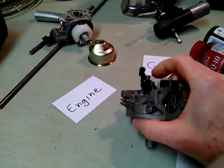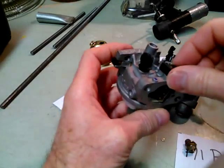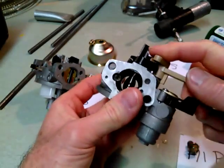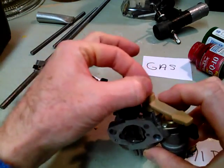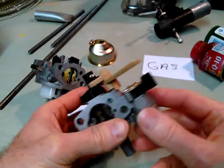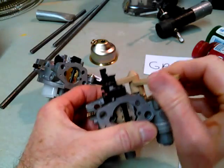One thing is that normally the choke doesn't have much friction, so it would move around when running unless it's wide open at the normal detent. When I was trying to remove mine to bore out more material, I kind of bent it — I realized you can't remove these without breaking them. But that actually gave it some friction so it stays put. If that didn't happen, you could put a piece of rubber hose and sandwich it between the button and the air filter housing. Or you could use a piece of tin on both sides bolted here to give friction to the mixture control.